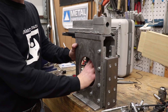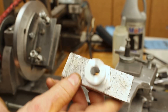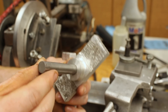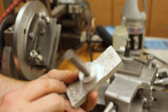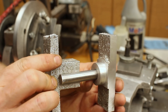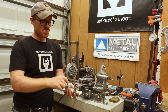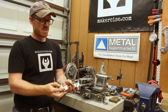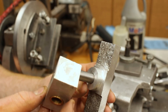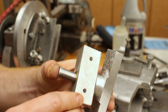I cast two blanks that I am using to turn down the bosses. These bosses mount on the inside of the shaper column — this pin is the pivot for the yoke. I'll turn down the other one, mount it up, face off the sides, turn down the outside of this protrusion, drill it, bore it out, and that way these two will mount so the yoke can pivot on this shaft.